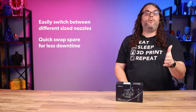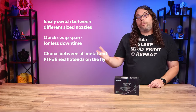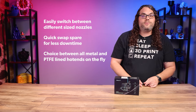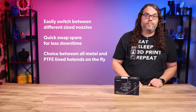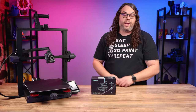Another reason is that some people may want to have the non-pro PTFE-lined and the pro all-metal versions and swap between them depending on what filament they use. A lot of people prefer PTFE-lined hot ends when printing strictly PLA, but would love to go all-metal when using higher-temp filaments. So those are some reasons why people may want to swap out the Sprite hot end or have a spare on hand.